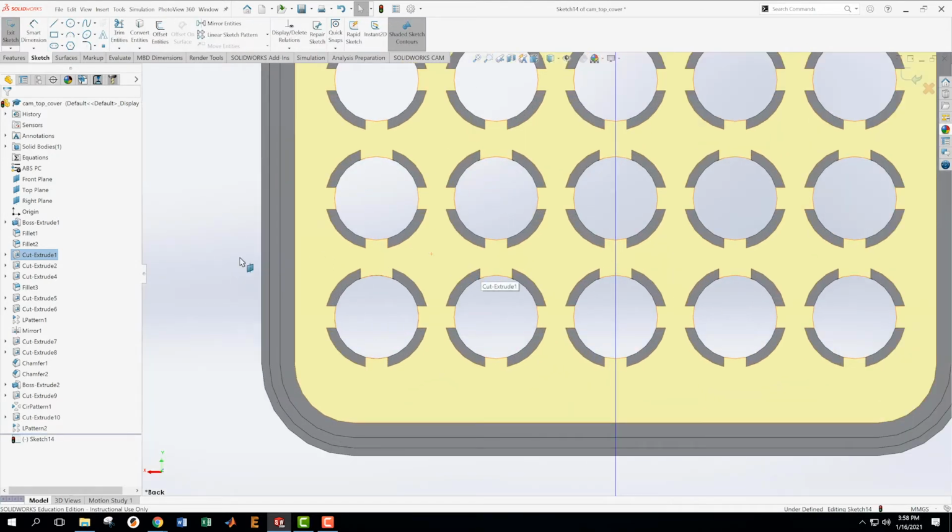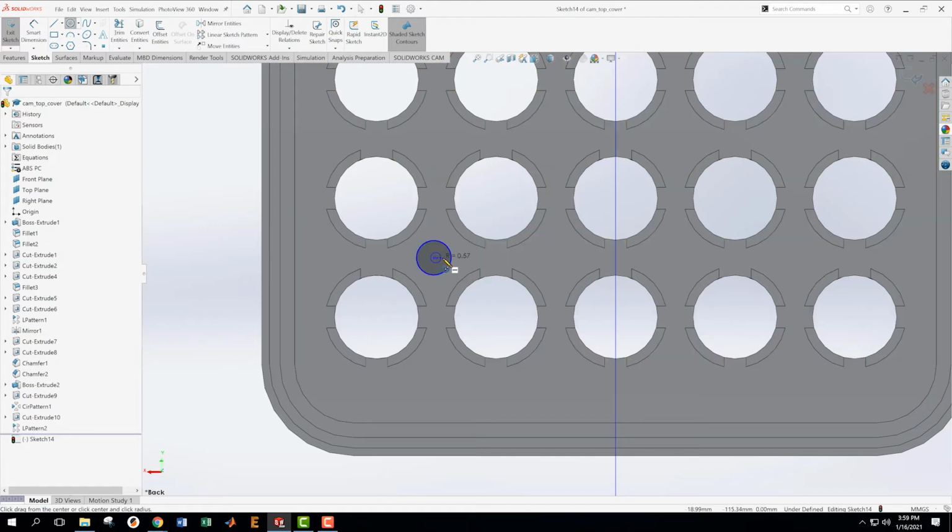Sketch. What I'm going to do, those should have been concentric. I can fix that in a minute. I'm going to check to see if these holes are at the depth, like the same depth. Like, can I do the operation at the same time? Oh, and it looks like I can. If I look at section AE, I can extrude up a ring instead of a whole cylinder and have to cut down a hole. So I'm going to do that. And my depth is 5.3 minus 2.4. I'll have to come back to that one in a bit.